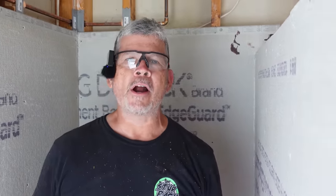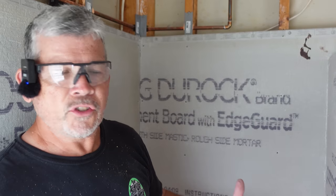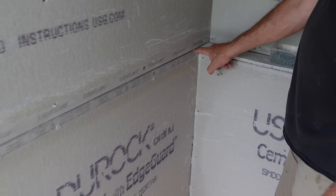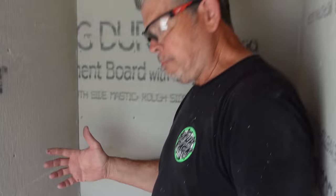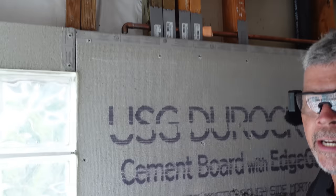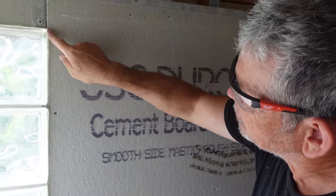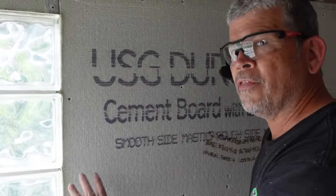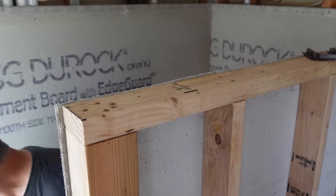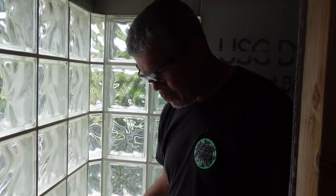Look at this gang — I'm standing in our shower. It is Monday and we demoed this thing last Thursday. Epic progress for the Stud Pack team. In the shower it is almost ready for waterproofing. We've got a three-foot piece of backer board here; the seam worked out perfectly for our ledge. We pushed the backer board as tight as we could against the glass block and embedded Lexel so it's nice and waterproof there. Just a couple more pieces of backer board here on the end and on the top. We thought it would be cool to angle the tile in the corner, but we really don't have the tools for that.